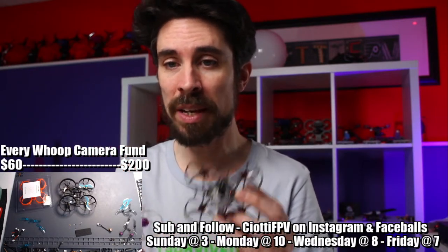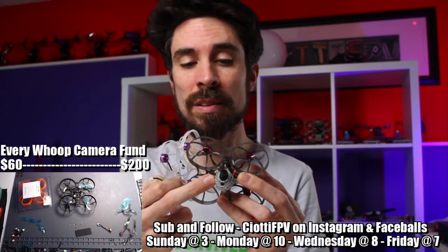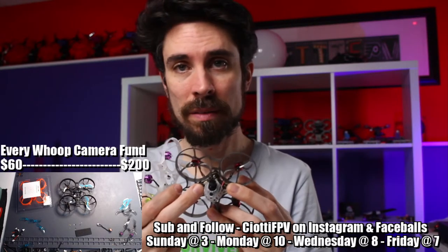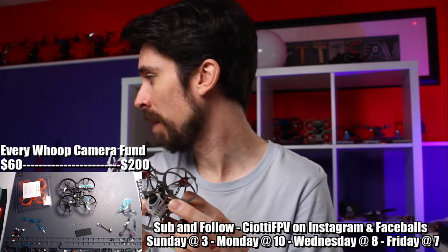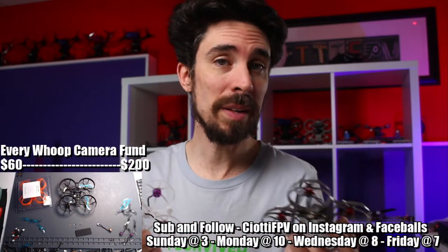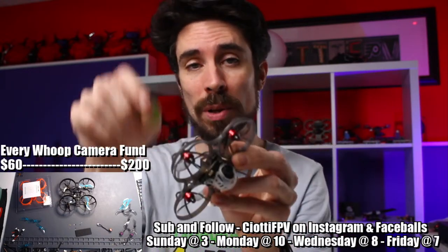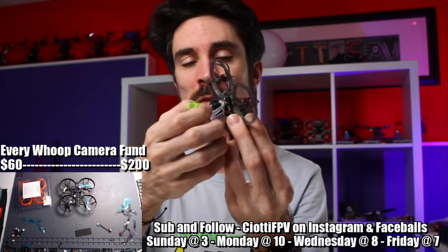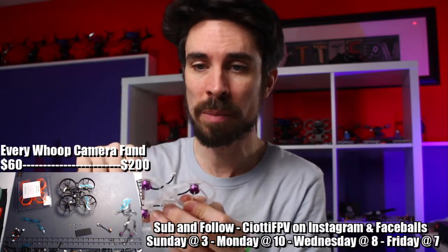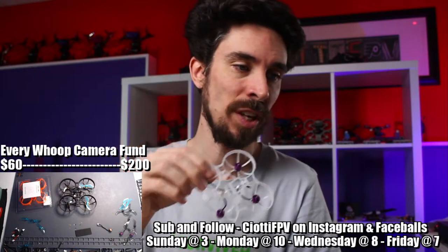The problem that I'm having is, in order to test these things back to back, I only have one of these Walksnail canopy VTX AIO setups. That's not true. I have the 65mm rig. What makes back-to-back testing hard is, I have to fly this one, and then I have to unplug all four motors, take all four screws out, pull the whole stack off, put the stack back in here, screw everything down, plug the motors in, go into Betaflight, and get the motors spinning the right direction, and then I can fly on the different set of motors.